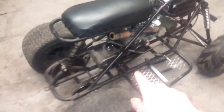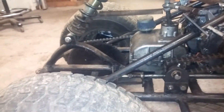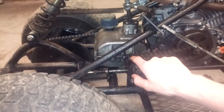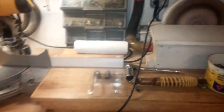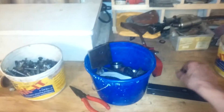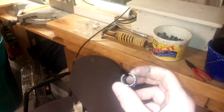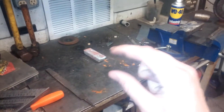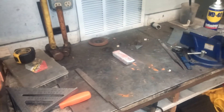I have the 12-tooth sprocket back on here. I also have a 10-tooth sprocket — the 10-tooth is for a 3/4 shaft so I made a little adapter using 3/16 plate with a slightly taller keyway, 3/16 wide by 1/4 inch tall, and it worked perfectly.